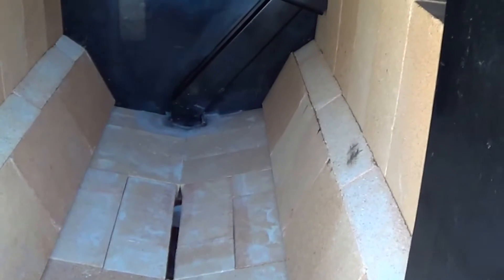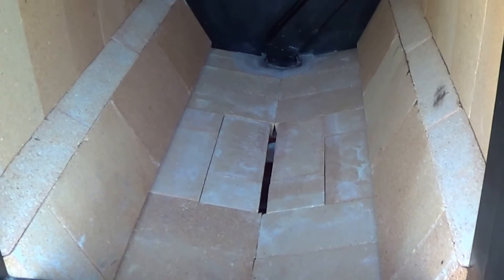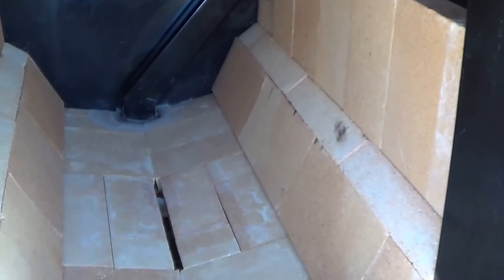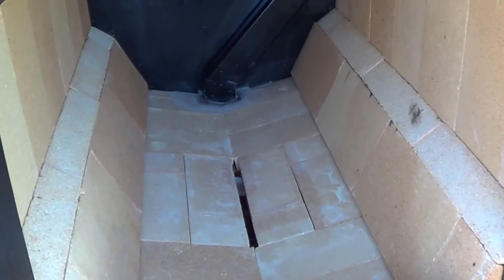There's a lot of fire brick inside this. This unit does a real good job of relighting from coals after sitting idle, because there's so much heat stored in that fire brick that once the unit calls for heat again and the air starts blowing, it relights pretty quickly. They did a real good job with relighting.